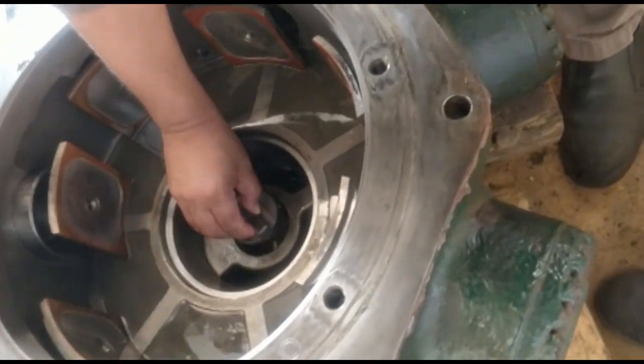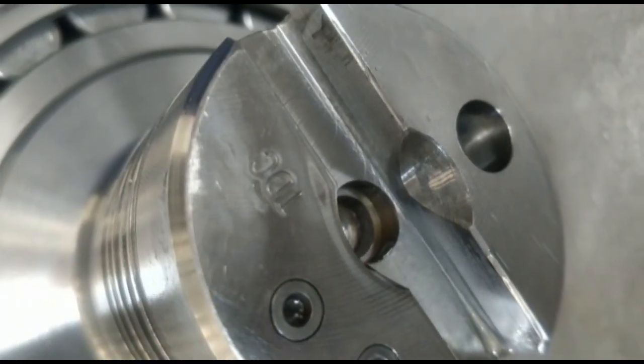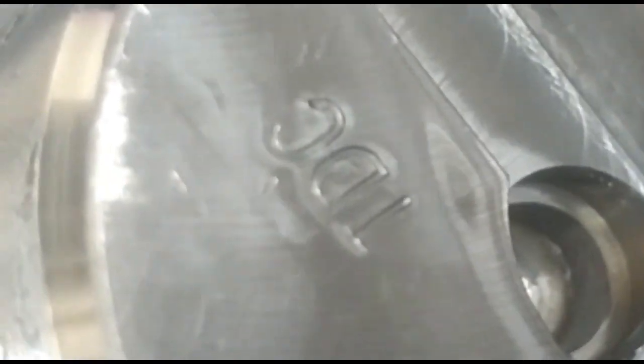This shaft is connected with the distributor by a plus-shaped Oldham coupling. The Oldham coupling, distributor, and the shaft end on the Oldham coupling side have a marking — TDC, L, or similar. This marking must be checked, noted, and at the time of assembly must be matched. If not matched properly, the motor direction will change.